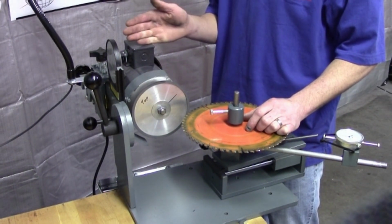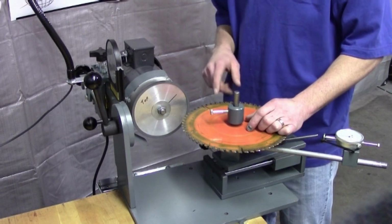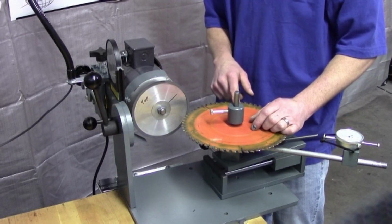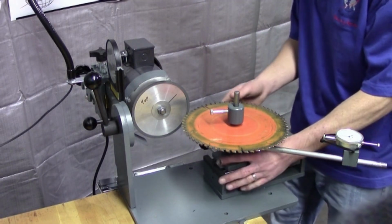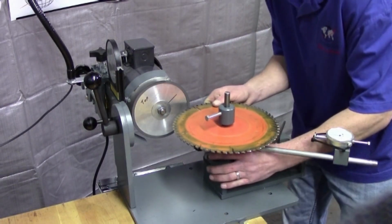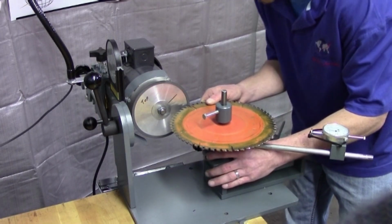So I got this one positioned about a 1/2 inch away from the end, and then I'll set up one of my flat raker teeth to make sure I got my top relief clearance, and we'll go through setting up this. So again, I'll loosen up my slide and my cone a little bit so that way I can position the tooth that I'm sharpening with the stop finger one.